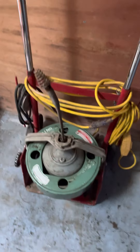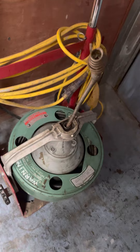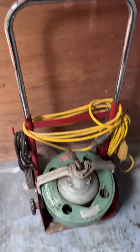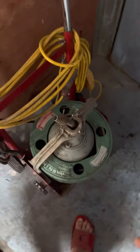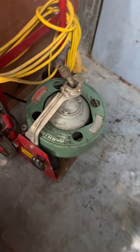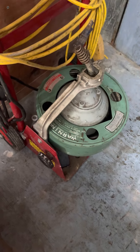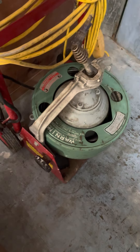Now here's one of my favorite machines too. This is a Spartan 100 model, and this is for doing floor drains and kitchen sinks — this is a mean little machine. I actually picked this thing up for like $1,200 off the internet from somebody out of state and had it shipped to me. These things are usually a couple grand, if not more, especially after you get the cable. Floor drains, kitchen sinks, showers — any line that's like 2 to 3 inches — absolutely amazing on that.